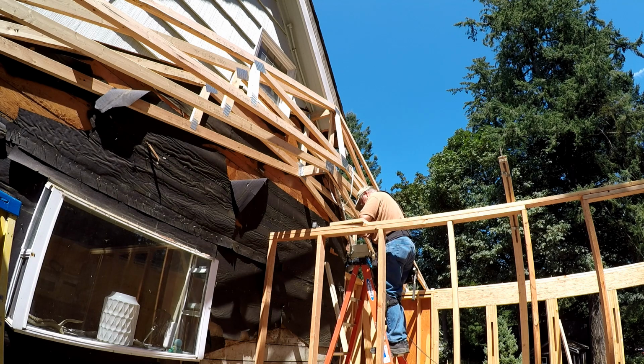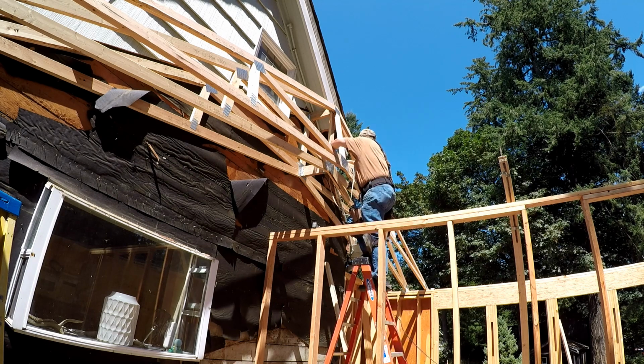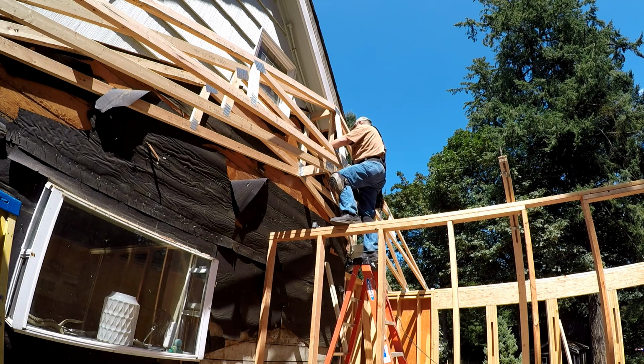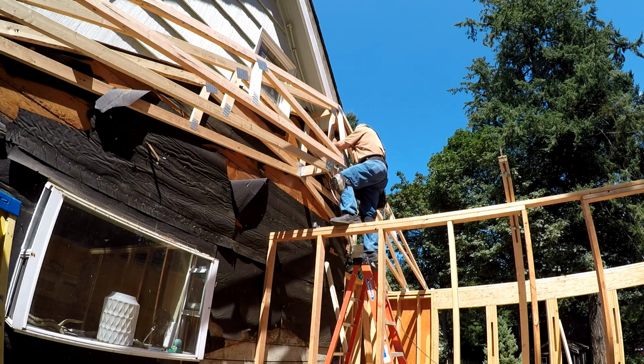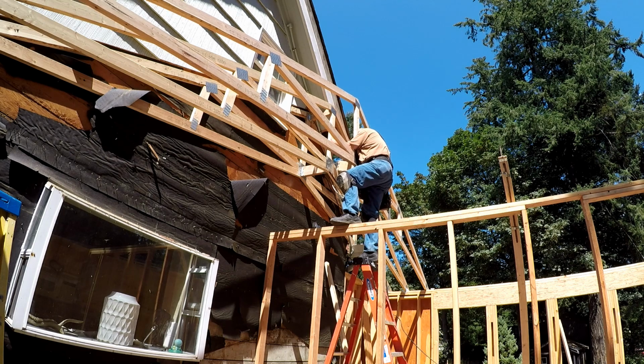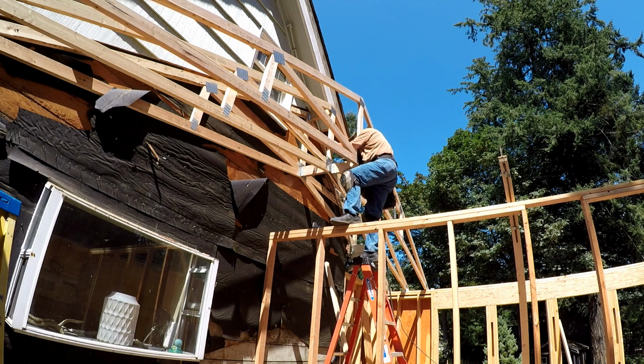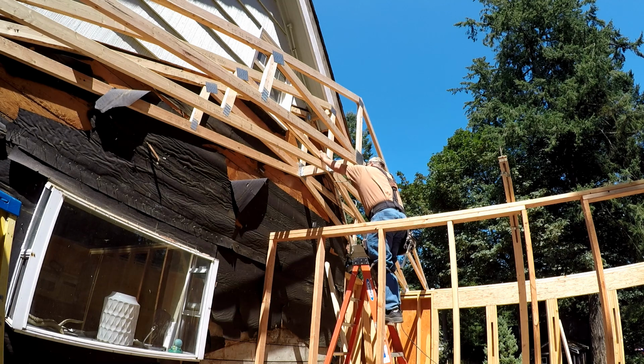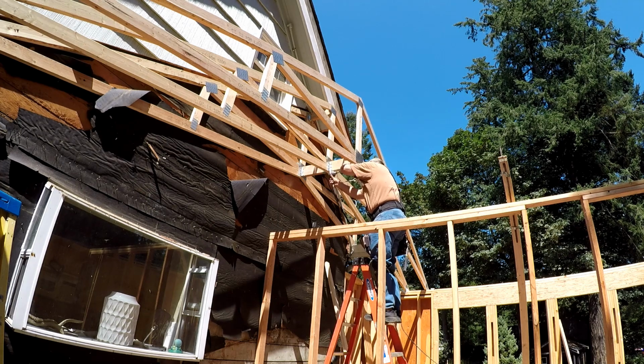Okay, so I just wrapped a piece of 14/2 electrical wire between the two trusses, and that is to prevent the truss number 3 from accidentally falling forward. And you see that I have a center wall built there, and we put that up so that if the trusses fall, they will fall onto that wall and not all the way around, upside down. And then it also makes it easier to slide the trusses from where the stack of trusses is in the center of the house into each of the consecutive positions.